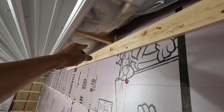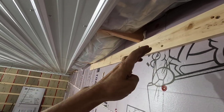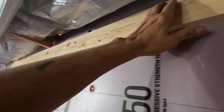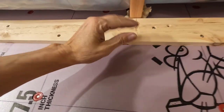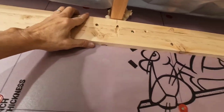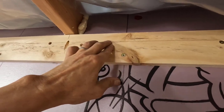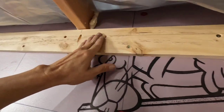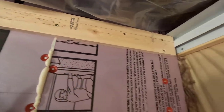All right, just like I said, I clamped this nice and tight up to the joist. It's actually hung up on the joist hanger, but that's fine. So I got it nice and tight up there, then put two screws along the side of it in place, and then put that screw up into the joist there. And she's nice and flat against the wall and as tight as it can get up to these joists. When I put the F and J in there, that'll be right up to the joist. This line right here is at 1¼ inches. That should hit the top plate, but there's places where it's not going to, so I'll have to go lower or whatever I have to do to hit the top plate in those places. It doesn't matter if there's an extra hole there or not.